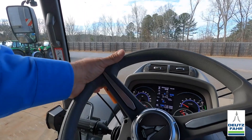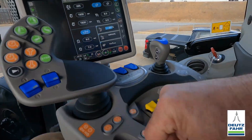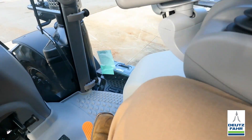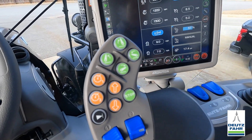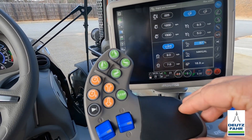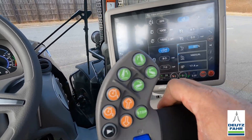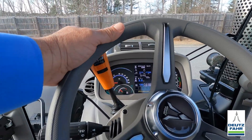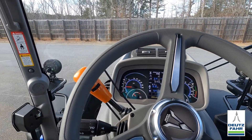To run the tractor in manual mode is real simple. Put the tractor in the direction you want to go — I'm going to put it in forward. And we are moving. I can increase my throttle with the hand throttle or use the foot throttle. I can increase my speed by pushing that lever forward and holding it, or I can bump it. I can also shuttle and change direction without stopping.